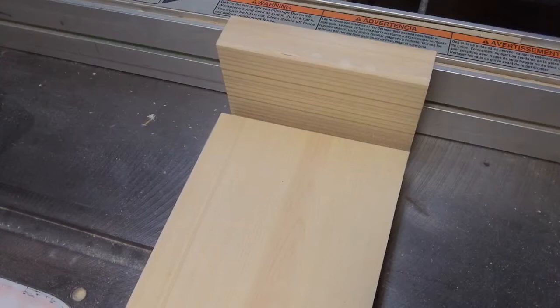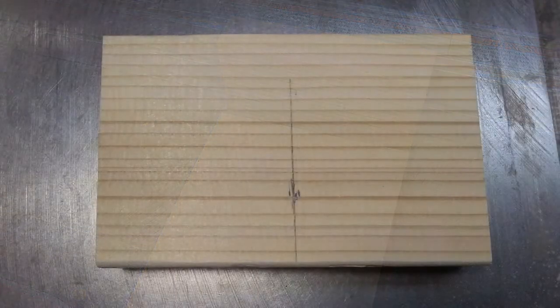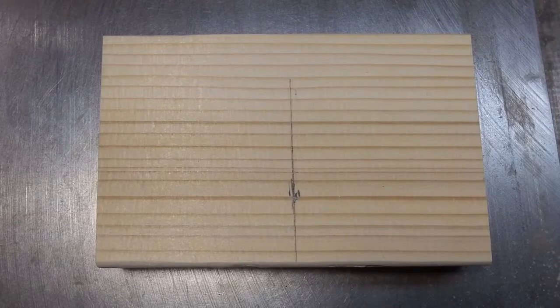For the water bar, I usually use just a piece of 2x4. This normally gives me plenty of support for the 3/4 inch T that's going to go through there. Then you want to measure and find the center of the board so that you'll know about where to mark it for drilling.